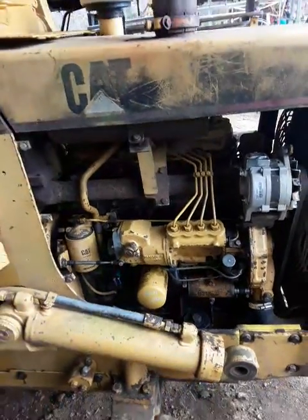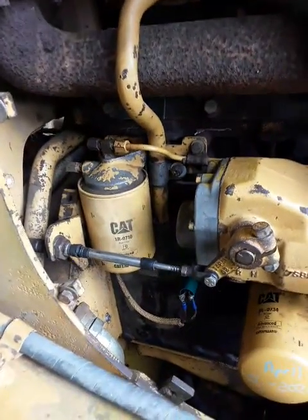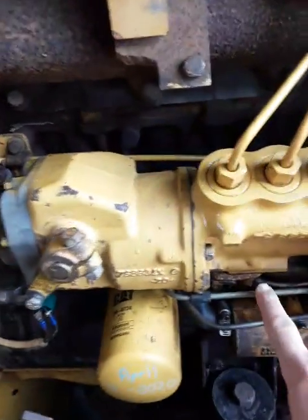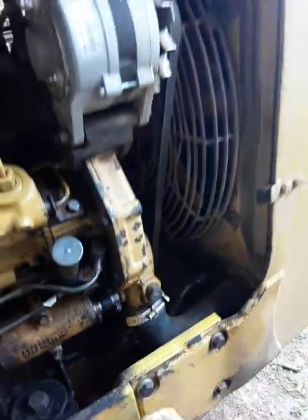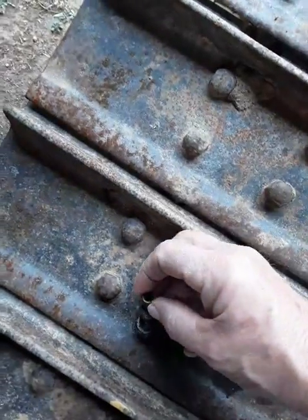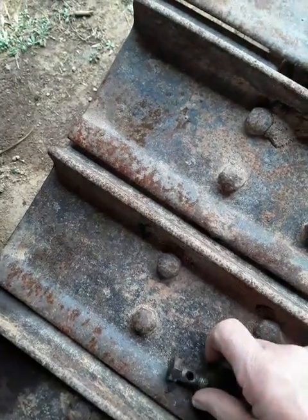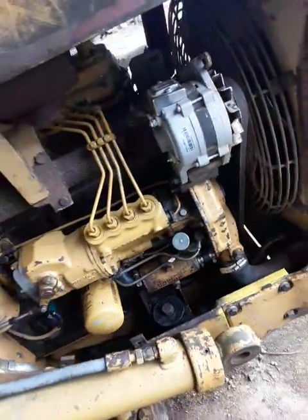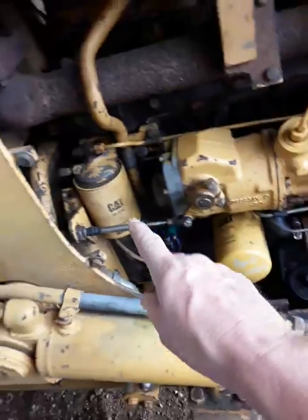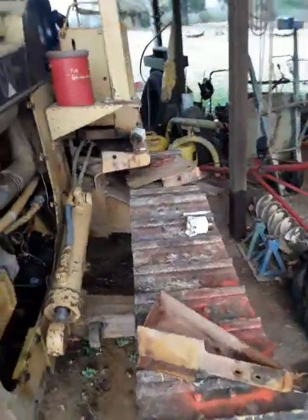So I put nozzles and lines on it, it's in pretty good shape now. But during that I didn't even realize that on this tractor, the fuel line comes in right here — actually it's this lower one — and it goes through this banjo fitting into this lift pump. Well, that banjo fitting has a screen in it. This little screen, and I poked a hole in it because it was all clogged up with stuff. I ended up buying a new one and putting it in there. But that little banjo fitting filtered all the fuel before it went through the lift pump, went back through the cat filter, and then back to the pump. So it was pretty stopped up. I didn't know that tractor was made that way until I pulled that apart.